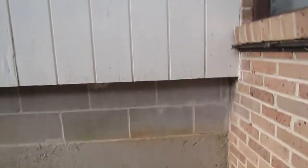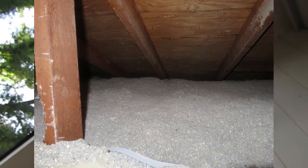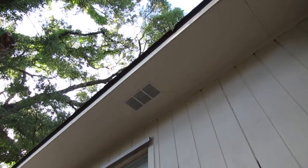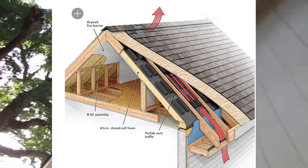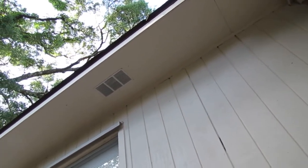As I mentioned in my other video, people take paint sprayers and spray the soffit area, which clogs the screens so no air can get through the vent. Another problem I often find during attic inspections is that insulation has been blown over the soffit areas. You can actually see that at night too with a bright flashlight. If insulation is covering your vents, I recommend you remove the vent, push that insulation back, and create clearance there — because the way an attic vents is the cool air comes from the bottom side of the soffit, enters up through the attic, and exits through the ridge vent at the top. I'd say about half the attics I inspect are not vented correctly.